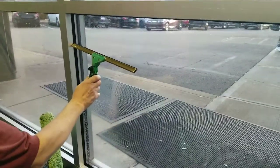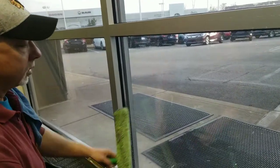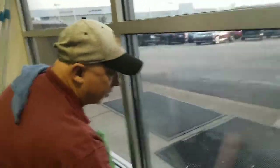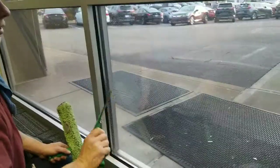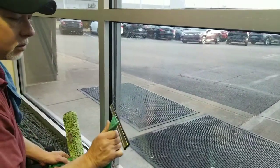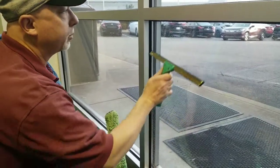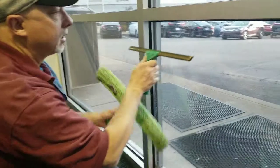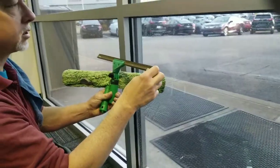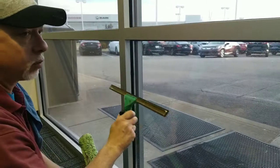It's less than my 18 inches of squeegee. When you're done doing this you're probably going to have a lot of water on your rubber, so you're going to tap it on an angle to get the excess water out. It's fairly dry but still not totally dry — we don't want to put the squeegee here because the rubber is still wet, and when you place it on the glass it's going to leave water on there.